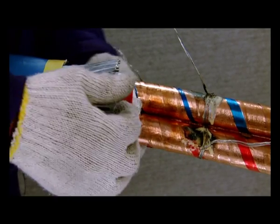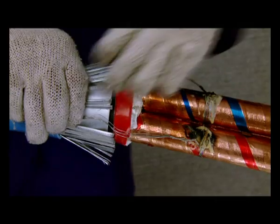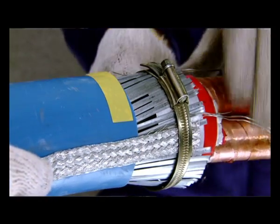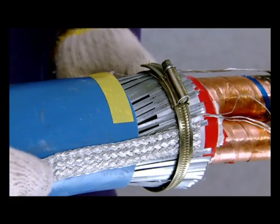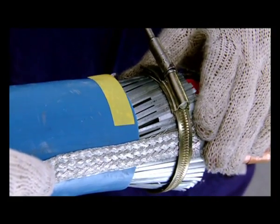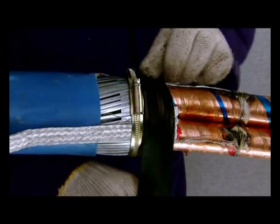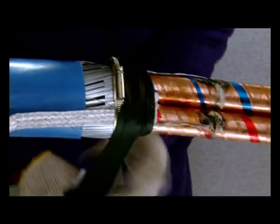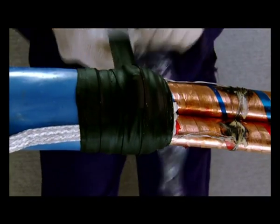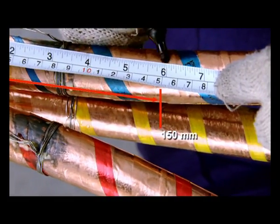Insert the backup ring under the exposed armour. Extend the fixed copper binding wire down towards the wire armour for main earthing arrangement. Wrap one layer of copper braiding around the armour with minimum 30 mm overlapping. Also insert copper binding wire under this assembly. Tighten the complete assembly with Jubilee clamps. The remaining copper braided strip should be taken out for connection to the earth point. Wrap two layers of mastic sealing tape over the earthing assembly and sharp edges if any.